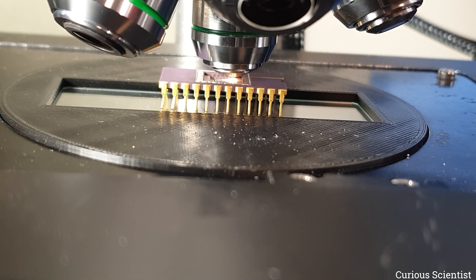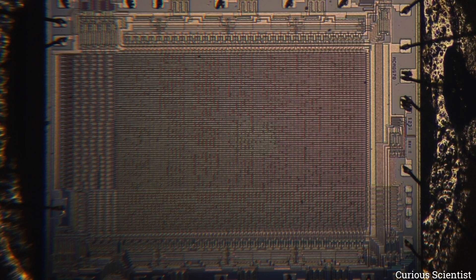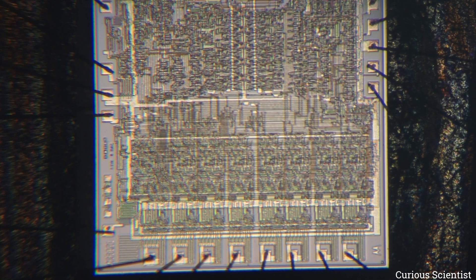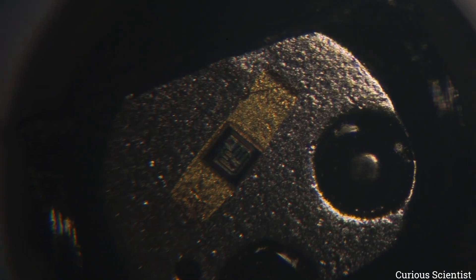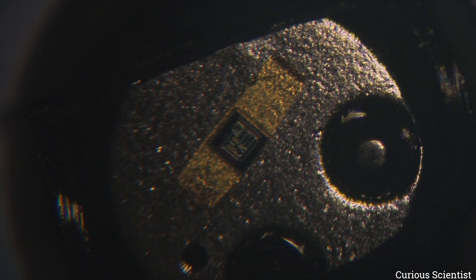So enough introduction — let's see how the microscope performs with the new lenses. Let's start with the 2.5x lens first. With this lens we have a few centimeters of gap between the subject and the lens. As you can see the image quality is not the best here. The image towards the edges is distorted, however this is not 100% due to the lens — it could be that the surface of the chip was not perfectly flat, so I could not focus the whole surface due to the narrow depth of field. I tried another chip that produced better results but it was still not perfect. Also I tried to look at the transistor and the illumination of the subject was quite poor. I think this is because the lens is so far away that the reflected light from the surface gets too scattered and not all of it reaches the lens.